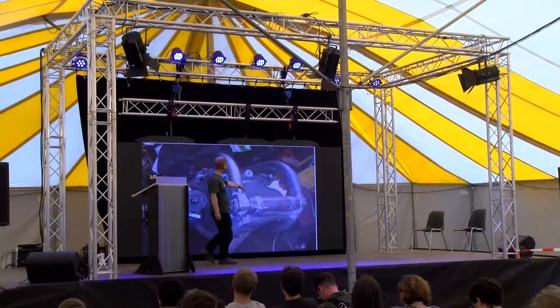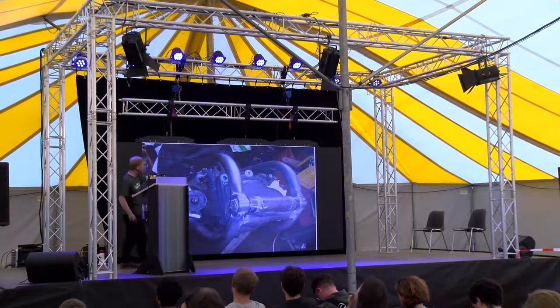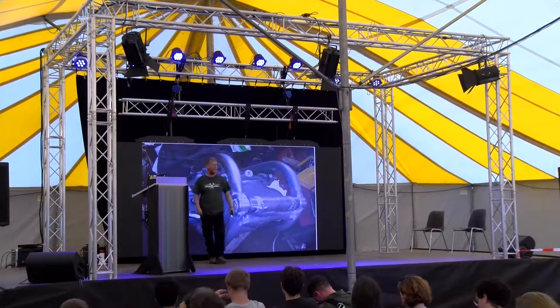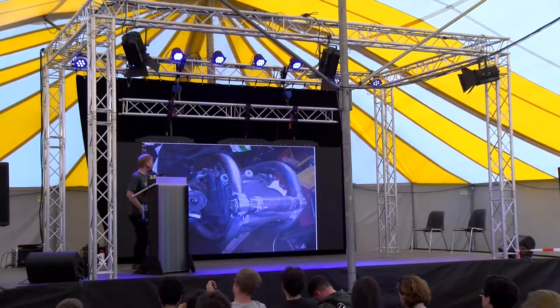And then the rear wheel will be bolted onto the shaft to allow suspension, and that's how I got it around the engine and the gearbox, with it being as compact as I possibly could. It's also copying the layout of the tubes and this bracing support underneath directly from the BMW frame and chassis. I thought, if it's good enough for them and that didn't fall apart, then it'll be good enough on here. And I copied the idea. And again, that's the rear subframe, just as a shot to show the bike kind of coming together.